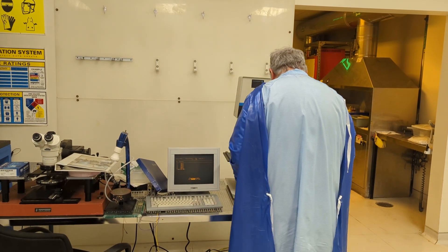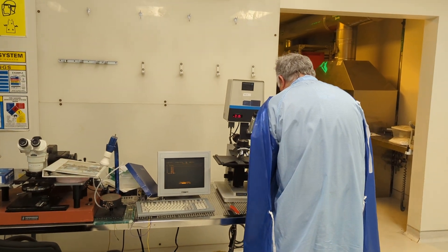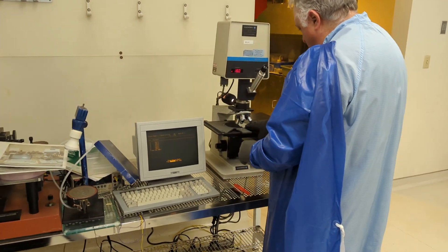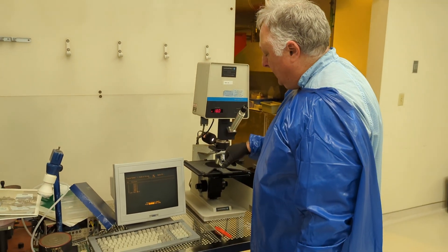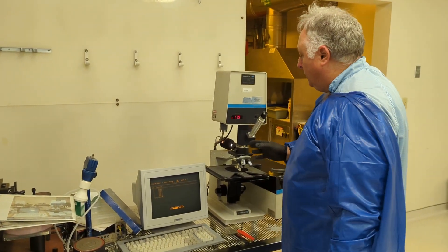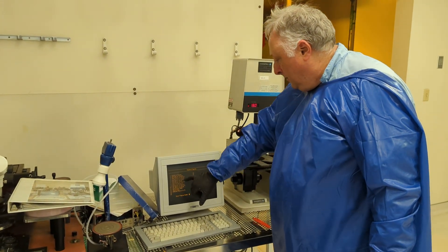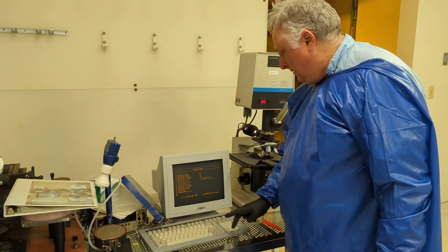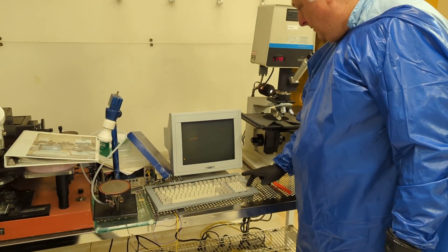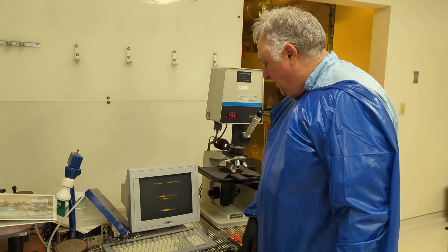We just put the reference anywhere. In order to measure inside the smaller hole, we need to be on 10x magnification. So just press calibrate — it brings back the menu. Select 7 for thin oxide, then 1 for 10x. Then scan new reference. You better scan it. Measure one ready.